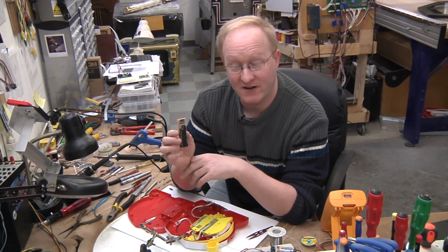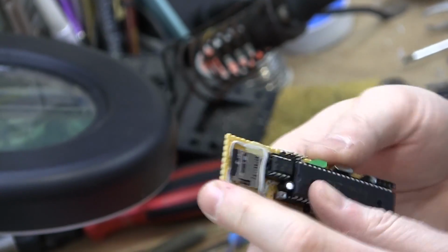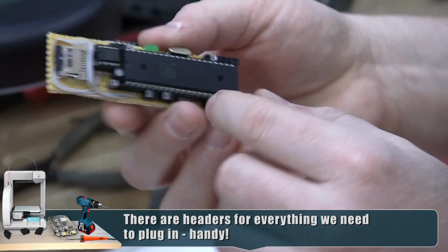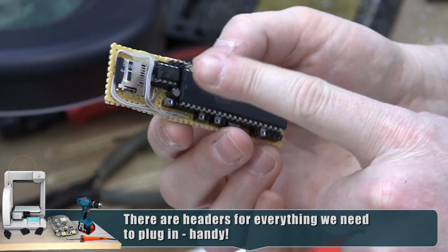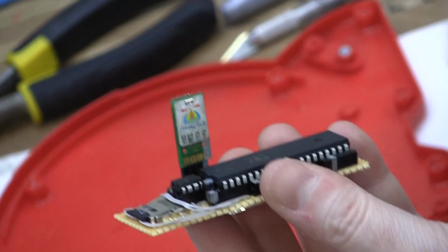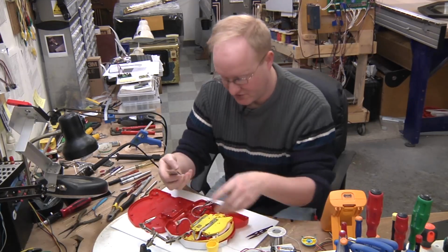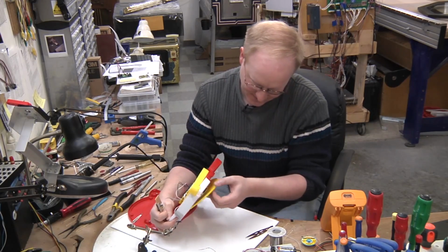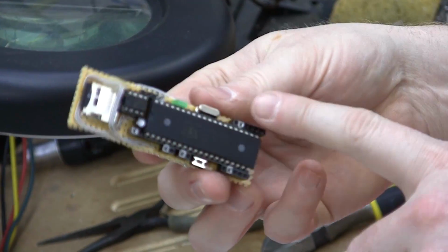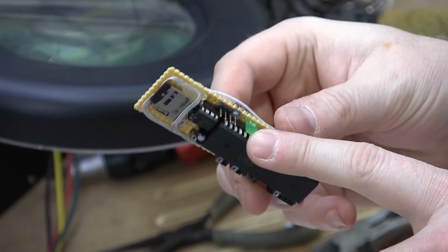Here is the microcontroller I wired up to give us our sound. I'm using the Parallax Propeller. It has 8 cores. It will easily be able to run sounds for us. Then I hand wired this micro SD card because it takes up a lot less space than a full-size SD card. There's the EEPROM. This has the code on it that the Propeller loads when it boots. And there's a programming dongle right here, so we can program it from the computer. And then I've added a variety of ports. There's power in, there's flip switch. Flip switch is when this thing flips, so it knows which side it's on. Audio out to the amplifier. And then these are the 10 inputs, 5 on this side, 5 on this side, plus ground. And this indicator light basically just blinks so we know that everything's working.